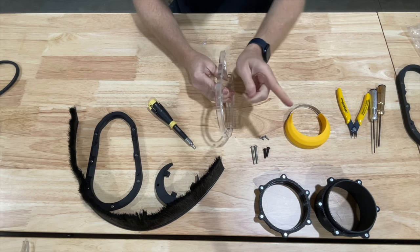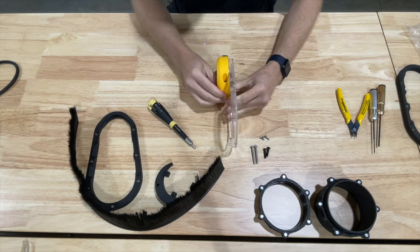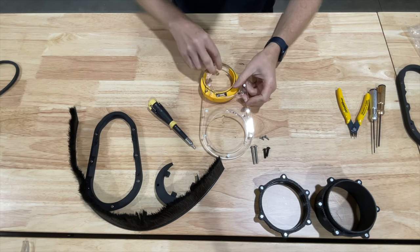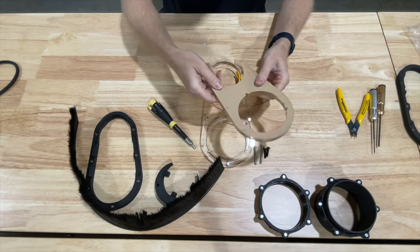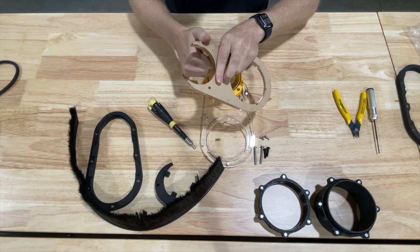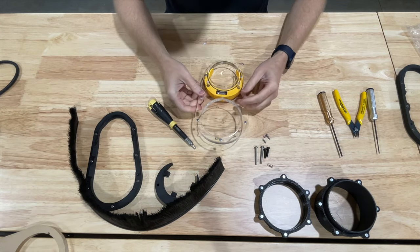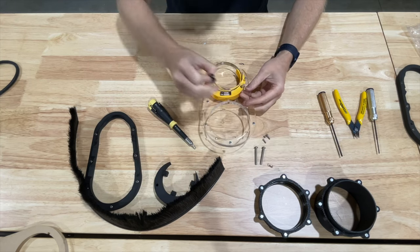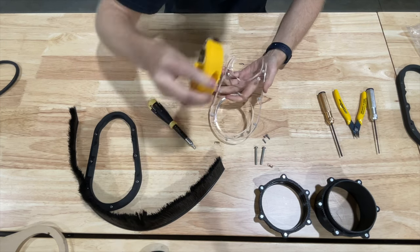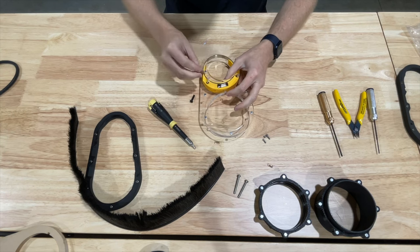The magnets are on this side. If we're mounting this onto a water-cooled spindle, we're going to put the collar right up there and these two screw holes should line up with the heat inserts. Your acrylic may have come with those in place — just pop them out. For water-cooled spindles which are not using the spacer, we're going to use the shorter screws. If you're using an air-cooled spindle, you'd use the longer screws.